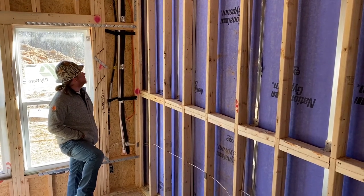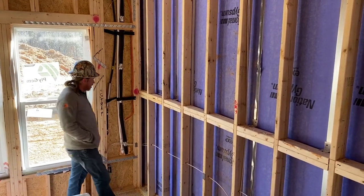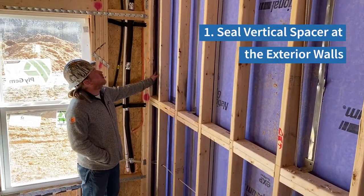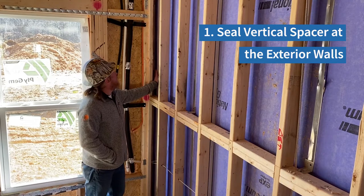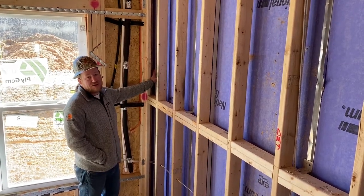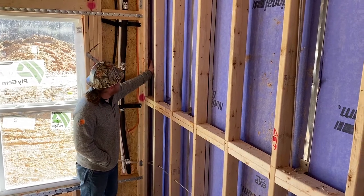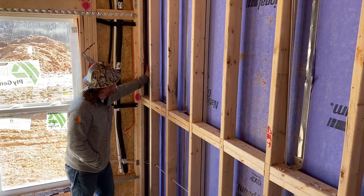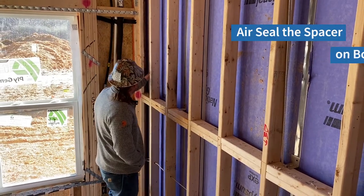The top five things that we're going to look at — let's start with the corner back here. We need to have a drywall spacer because the way these walls are built, there's a gap in the construction and that allows a significant amount of air leakage to enter the building. So having an extension of your core wall, this drywall spacer right here fills that gap. Now what's important is that it's air sealed in.